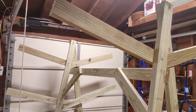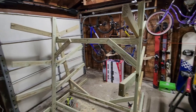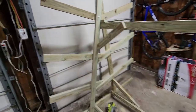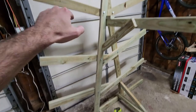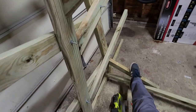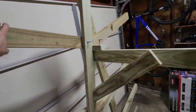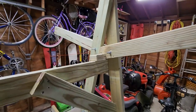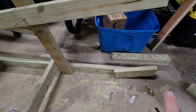The bottom two arms are much stronger — they could hold my weight all the way out to the end of the arm, and I weigh 200 pounds. It is done, completely finished. I've got all my arms on. This is going to hold eight kayaks — four on each side. The last couple things I did was put cross-bracing on the bottom, and I put a couple of little blocks up top to give the upper arms a little more lateral stability. I also added small pieces to the bottom to give that bottom rung a bit of an angle too.